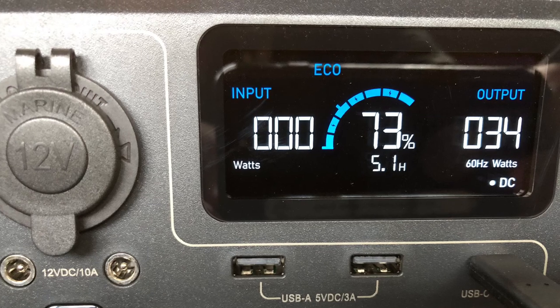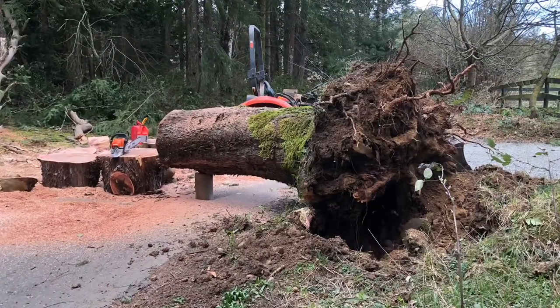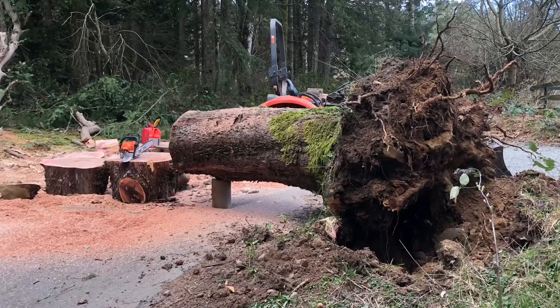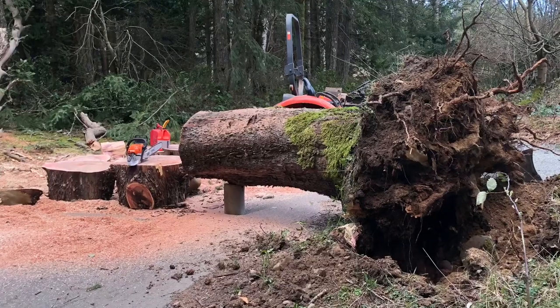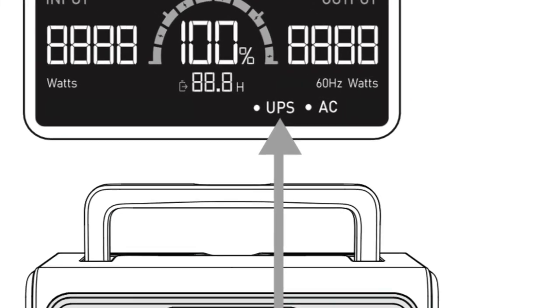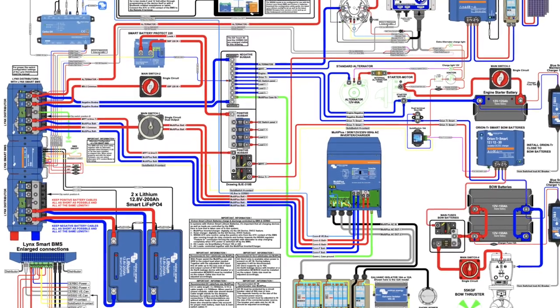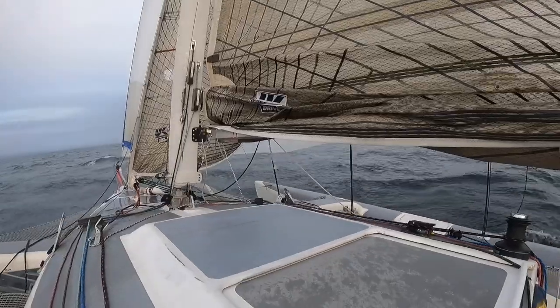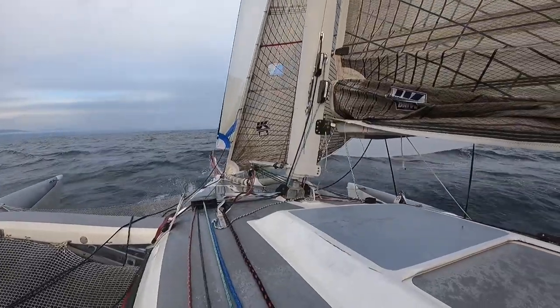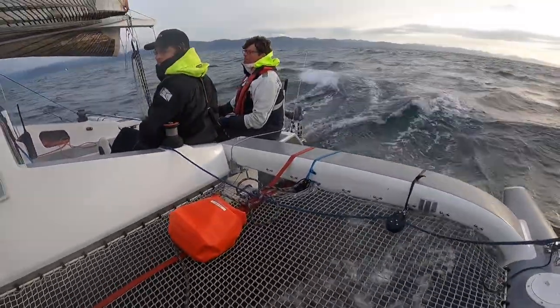There's one more really cool feature of the EB3A I want to tell you about. Remember that storm that knocked out our power and caused me to buy a Bluetti portable power station in the first place? Well, when it knocked out my power, it also knocked out my internet, and the EB3A has a solution for that too with its UPS mode. You can plug your computer equipment into the AC outputs, and as long as the EB3A has AC power flowing to its inputs, it will just bypass the battery altogether and power your gear straight from the wall. But when the power goes out, the battery and inverter in the EB3A will take over and keep your computer equipment running. I love the EB3A because it contains all of this complexity in a lightweight, portable package that only costs a fraction of what this all costs, and it lets me spend less time working on my boat and more time sailing. Plus, I know exactly what my batteries are doing, and if it breaks, I can easily swap it out with another one. And because it's portable, I can easily move it between boats and use it in my truck camper too.